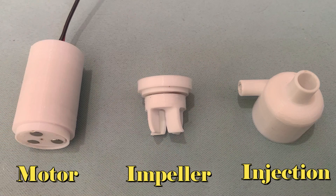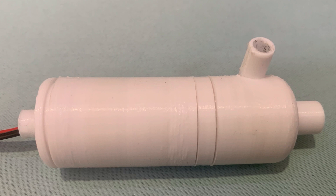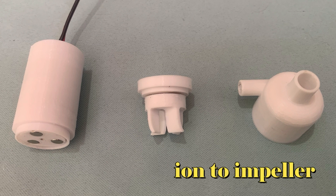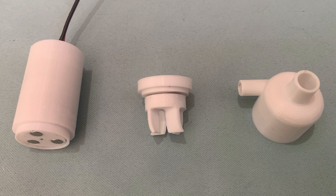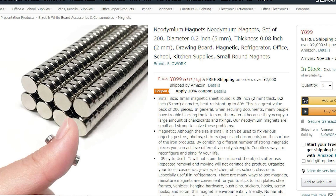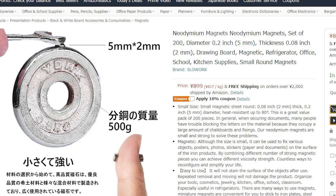Let's start. The concept is simple and clear: take apart the motor rotation part from the water injection part — it is 100% waterproof now. The difficult part is how to transfer the motor rotation force to the impeller. I used magnetic force this time. Use neodymium magnets to complete the quest. They are very small but very strong.